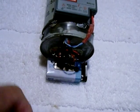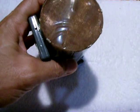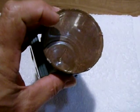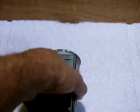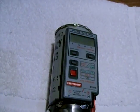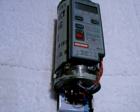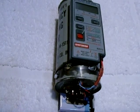The entire circuit only draws 1.1 milliamps — the high-voltage board draws 100 microamps and the circuit underneath the cap draws roughly 1 milliamp. So this can run a very long time on a 9-volt battery. I'm very happy with it. The only thing I'm going to do is take Charles Wenzel's advice and replace the insulator between the copper electrode and the chamber itself, because I think there might be a little leakage causing a slight upward drift in voltage after it's been running a while. If you're interested in making this, visit techlib.com, click on ionization chambers page 2, and you will see the super sensitive ionization chamber with detailed instructions and a schematic.